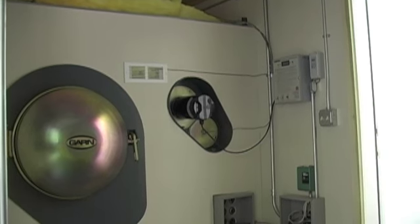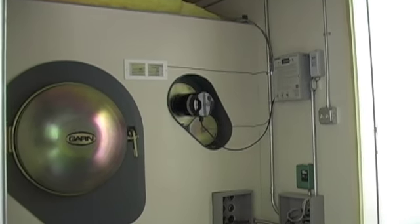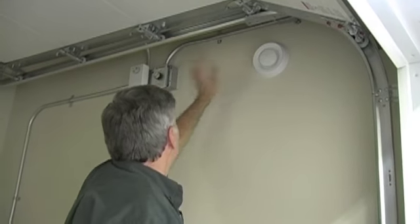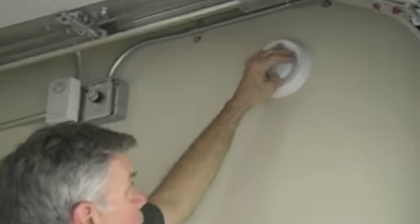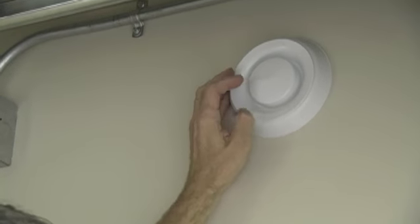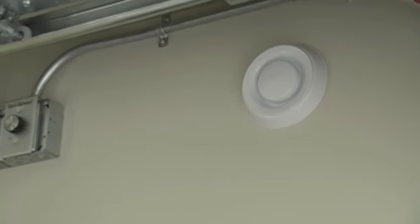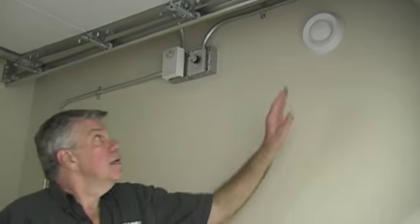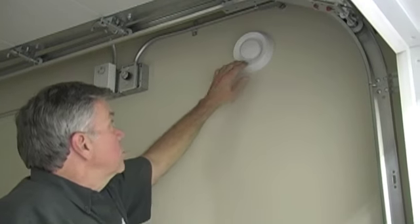I think that's about all. Oh, one other thing is this is an exhaust fan, and it's hooked to a humidistat that will control the humidity inside of the unit here. So basically, if you bring in some wet wood, which you should be using only dry wood to heat with, but if it's a little bit damp, this humidistat will turn this exhaust fan on.